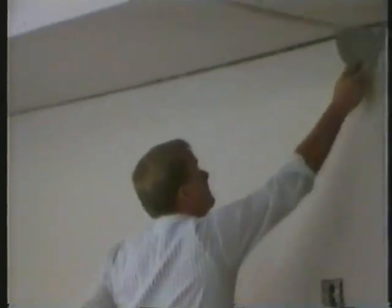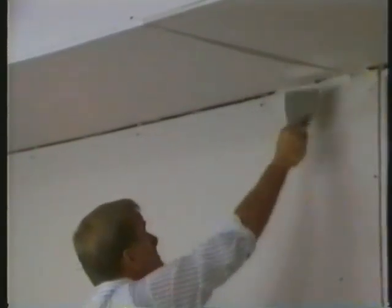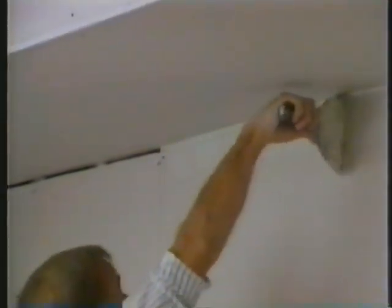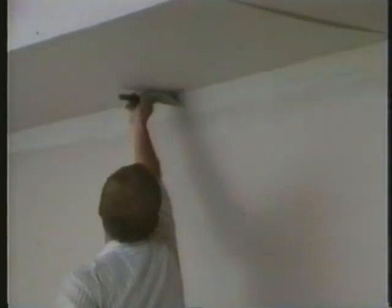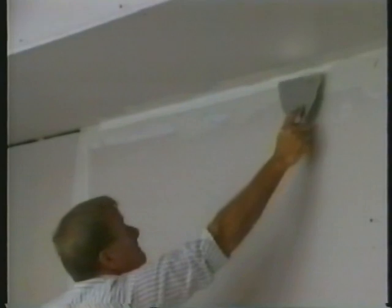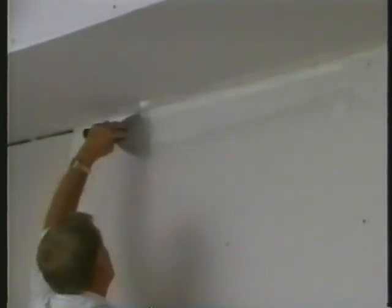Do-it-yourselfers who are finishing their basements or building drywall partitions need to properly finish the drywall seams before priming. Begin by filling in seams with drywall compound and a putty knife. When dry, apply another heavy coat of compound to which you apply a paper drywall tape. Bed the tape into the compound by pressing a very large broad knife or drywall knife over the tape.